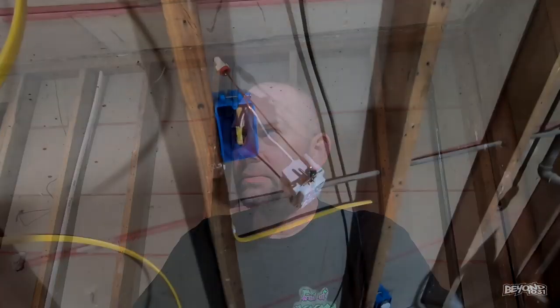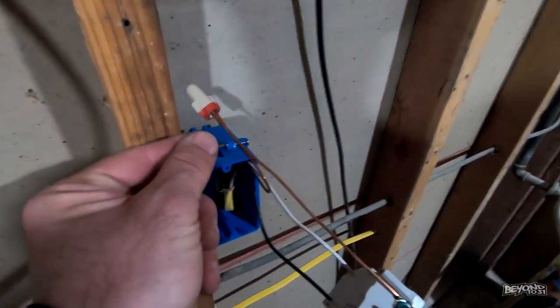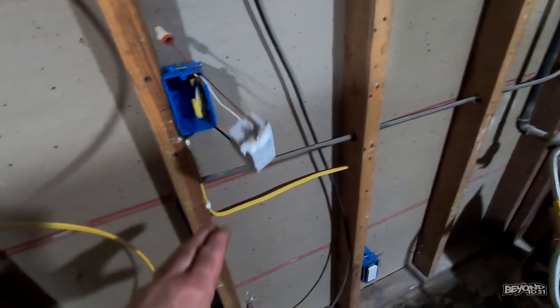I have to say that making coffee in my living room is freaking awesome. Every living room should have a coffee pot. Where is your guys's coffee pot? Probably in the kitchen — but if not, put in the comments an alternative place for a coffee maker. I also got this wired in — this is just temporary. This is how you have to do the ground: you can't connect two grounds coming from different wires without piggybacking and wire-nutting them together. I've even stuck this stuff up there quite a long way. I just got through drilling a hole where I want the light to go and put a little piece of wire up there sticking straight up so I can locate the hole and see if I have enough space next to the beam up there. Progress.